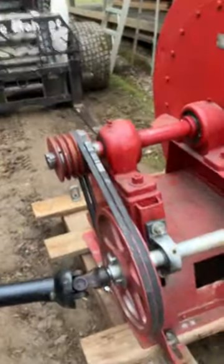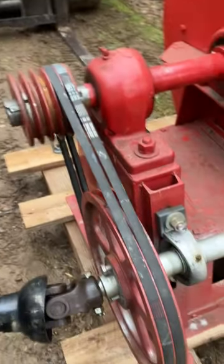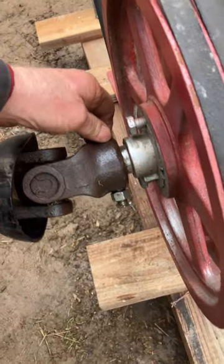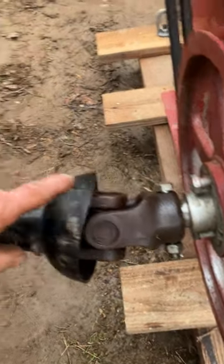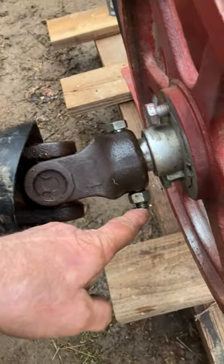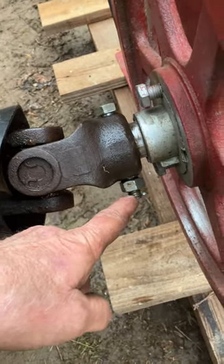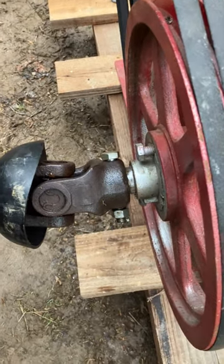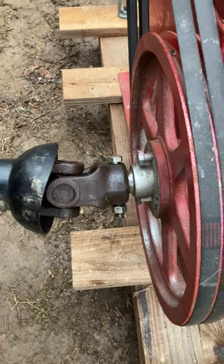After having those bolts come loose on that PTO unit in the back, I figured if this bolt here came out, it'd be a bigger catastrophe because it'd be hooked onto that. So what I did is I modified a bolt, put a flat on it, drilled a hole, and put a cotter pin on it. So if it comes loose, it can't come off. I don't think it'll leave — I don't think that's going to shear anyway.